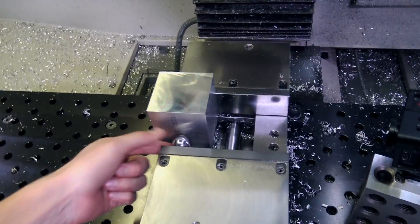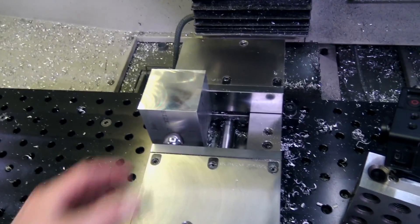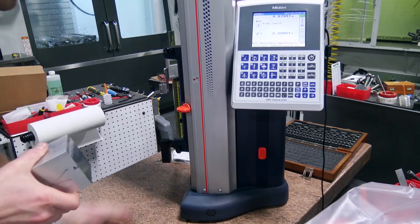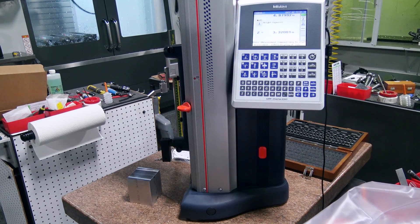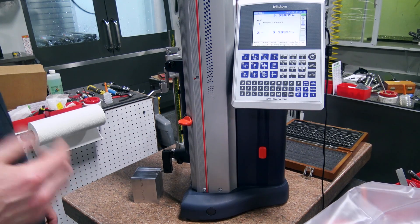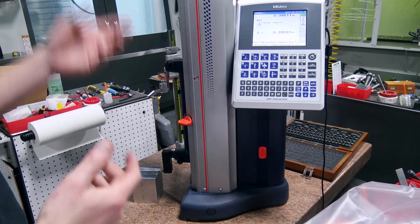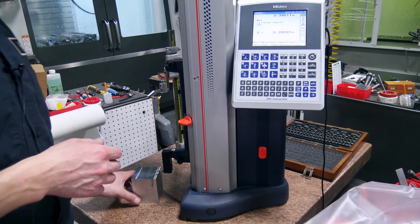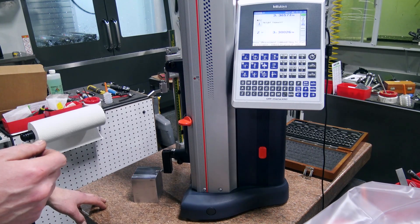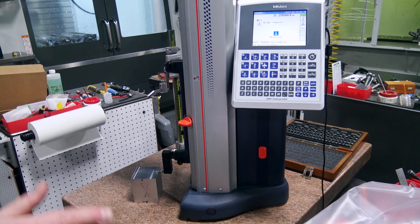That gave me a chance to remember to use screw balls. I loosen the vise, pull out the screw balls - these have a ground flat. Machinist 101: squaring up a block. Not as easy as it looks. Famous last words - I think I got it. We certainly have a good surface finish. Let's go measure it up. We push the down button and it automatically measures: 3.2993, so seven tenths under on that corner. This is our new Mitutoyo height gauge. Seven tenths under, spot on, two tenths over - sweet. Four tenths - two tenths under - yes! That's awesome.